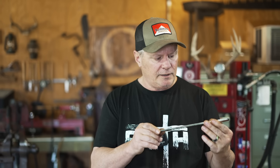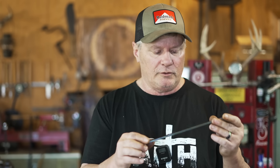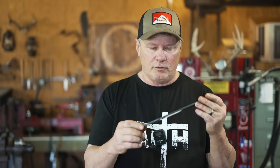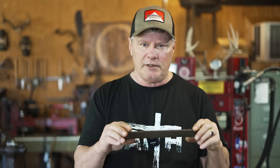We got our etch done. I could have taken it down a little bit more — a little thinner in other words — but it came out pretty good and it's ready to make a knife. You're going to always have weld inclusions and fooling with cable is notorious for that — it's why I don't like working with it, but when I do, that's how I do it. It forge welds really easily as you can see and the job gets done pretty nicely. I'll show a shot of it here where you can see the etch a little better. I want to thank you for watching, I want to thank my patrons, and we're going to see you on the next one.